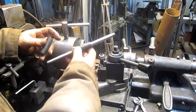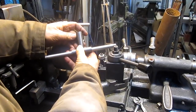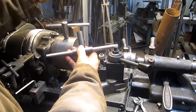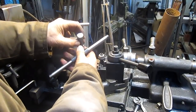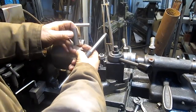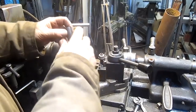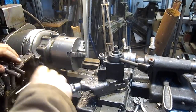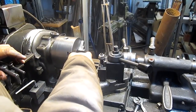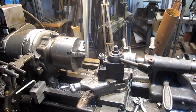We'll get this out. So basically, we've got to put a slug on the end of this to make some kind of T-bar, and then drill a half inch hole in there and tap it all the way down to the bottom. That's pretty simple. We'll just put this in the lathe and go ahead and center drill it, and then do maybe a 2 or 3 step drill.